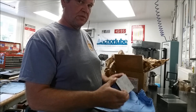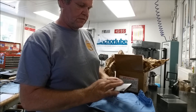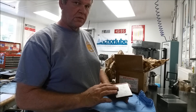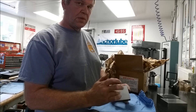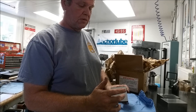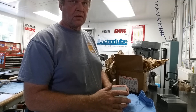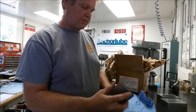Hey guys, welcome to Bar Z. My name is Stan and today we got a package from Adam. I already knew this was coming — he sent me a piece of mystery metal. This has been cratered and rusted on these sides, but it's a fresh bandsaw cut here. We want to test how hard this thing's going to get, so we're going to surface grind the whole thing, cut it in half, heat treat one side and leave the other in its normal state. We'll do a hardness comparison, and if it gets quite a bit harder, we'll take it back to the oven and temper it down. I'm going to use oil hardening methods because we don't know the structure of this metal.